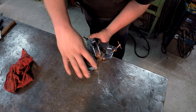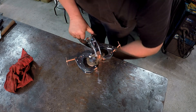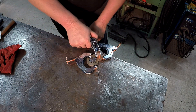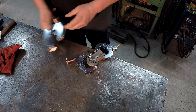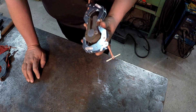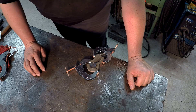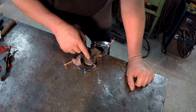Okay, alright. I think we've got everything tight. I just used that to try to make sure it was pulled down flat on the table there. The crack looks nice and tight. So we'll go ahead and see if we can get some nice tacks in there and hold everything together, and then I'm going to take this plug out because I don't want to weld it to the plug. That's where I really need some carbon sticks, but I don't have any.